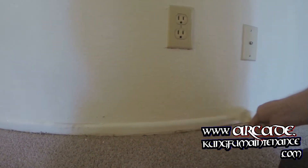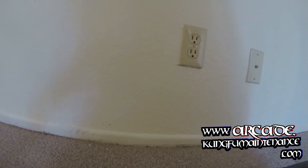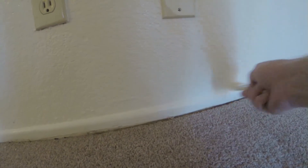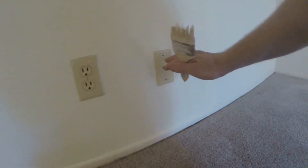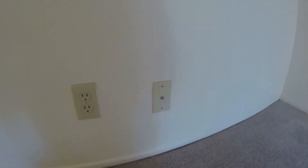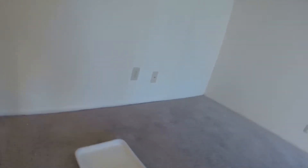The problem is if you go to paint or do a color change or change outlets, then you've got to slice off your outlets with a box cutter first. And if someone doesn't do that, they can pull some of the texture off the wall. So that's kind of a problem with caulking them on. I usually caulk the electrical outlets, and a lot of times the cable outlets I'll just leave not caulked because of that. But it still gives a much nicer, completed finish with less pests if they're caulked on, so I still like caulking them on. There are definitely some different schools of thought on that.